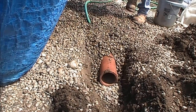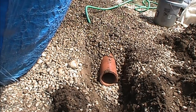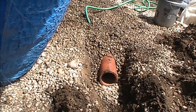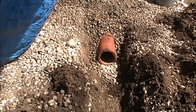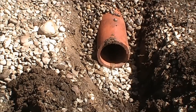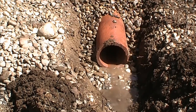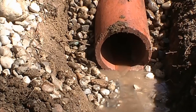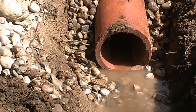I'm just going to stick it down in the ground so you can see. We've got water running into the trench, and in just a few seconds you can see water coming out of the pipe. It's flooding up through the gravel, and it's also coming through the gravel underneath as well, but most of the water comes through the seam of the pipe.